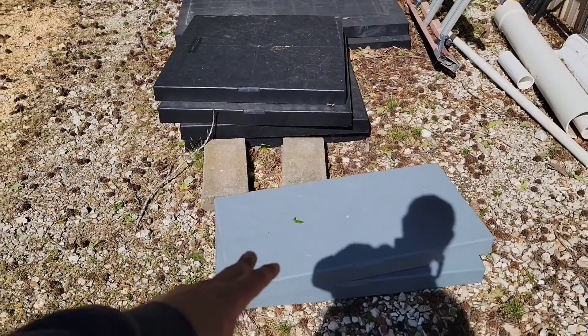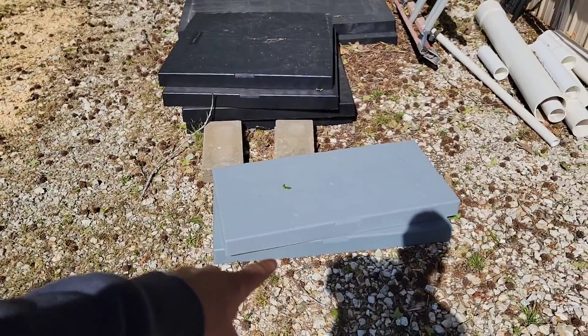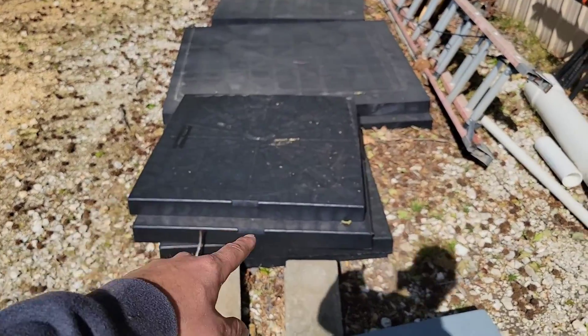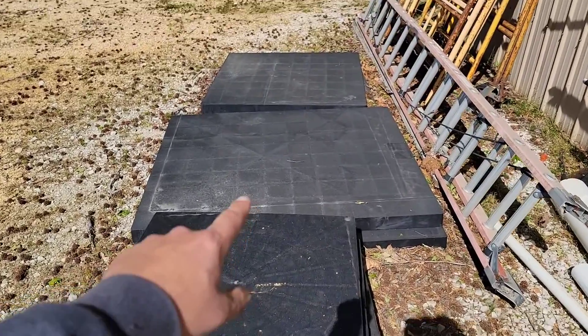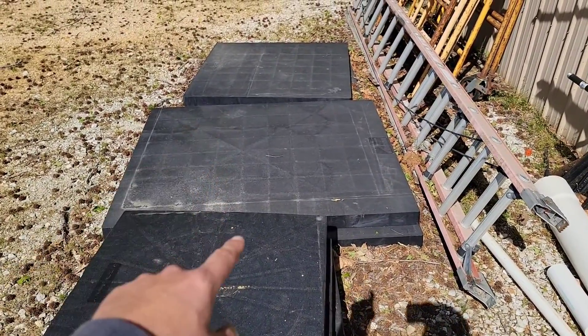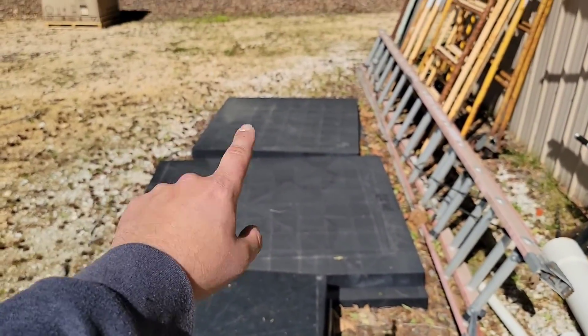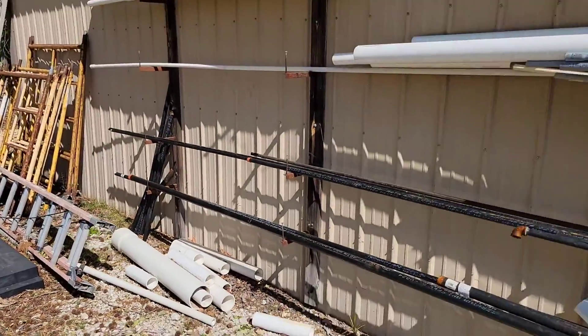There are different types of pads: pads for an outdoor mini-split condenser, ductless condenser, a 36x36 pad for a condenser, a 4-foot by 5-foot pad for a package unit, and a 4-foot by 4-foot pad for a larger condenser.